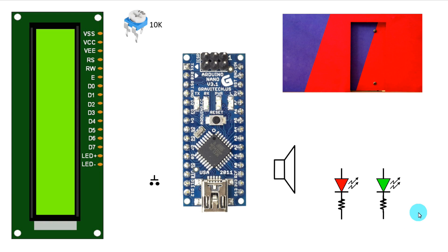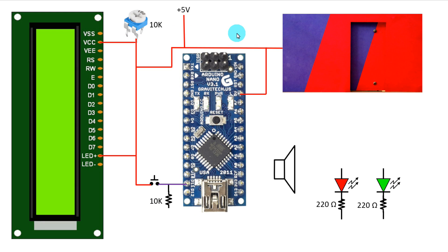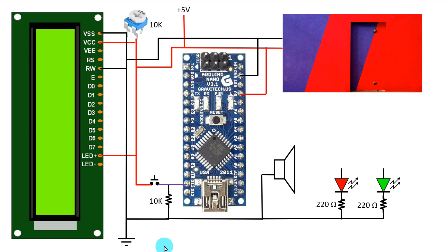Red LED, green LED, a switch to change the knock pattern. With the LEDs we have to connect a 220 ohms resistor. D11 should be connected to the switch, then a pull-down resistor should be connected to D11. Now I am connecting all the positive pins - I will supply plus 5 volts and it should be connected to the Arduino, the door, the potentiometer, display, LEDs, and the switch. For the display LED connection, with the negative pin I have connected a 220 ohms resistor connected to ground. The middle pin of the potentiometer is connected to VEE or V0 so that we can adjust the display. A0 pin is connected to the speaker.